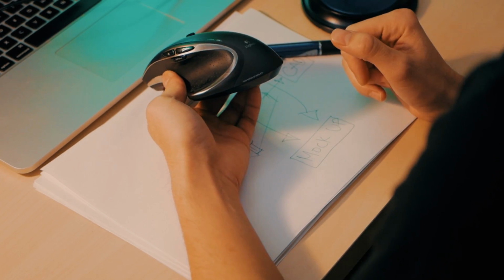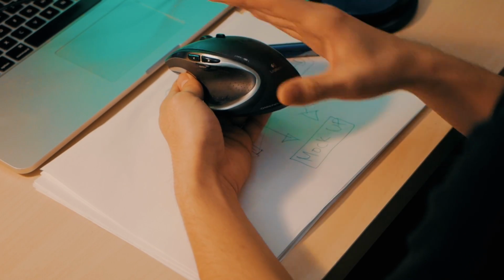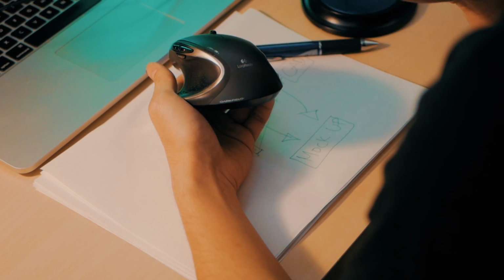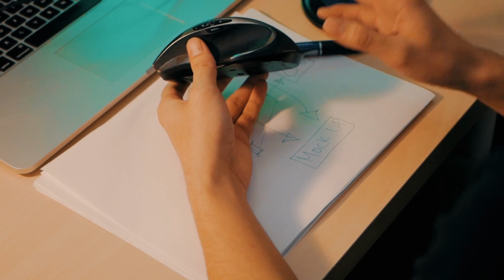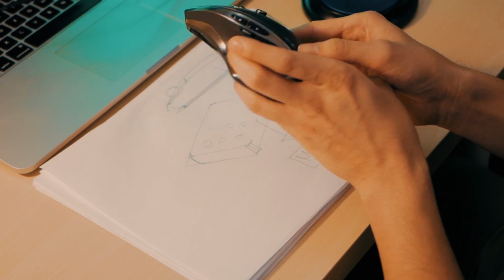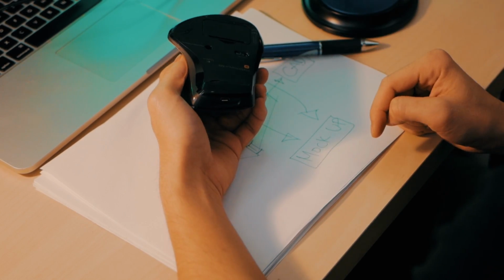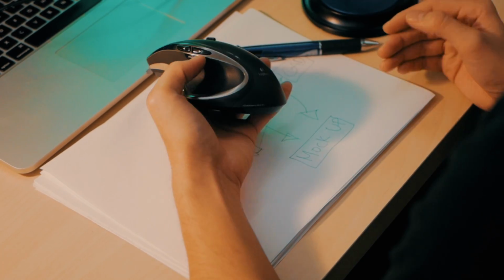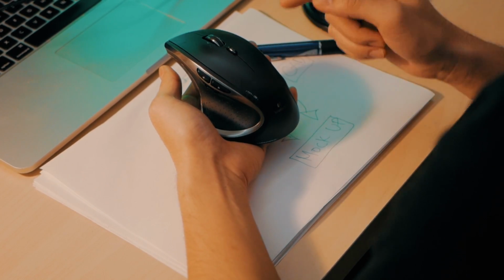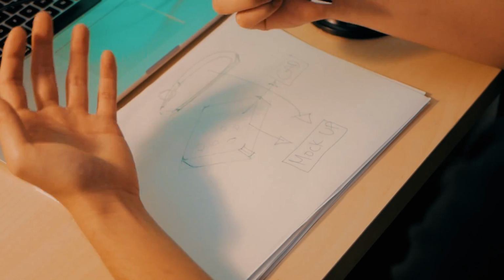This is something that I always wondered too. I knew about 3D scanning, but I was like, so what do you do with that? Do you start cutting away and modifying and changing that file? And does it come with all the features too? It was a missing step that I just didn't have. But what you do is you take that file from the 3D scanner, open it up, turn it around, move it around, and see your mock-up in the CAD program. And so you would use this file in order to create your own CAD file by starting from the beginning. Just like any CAD you would do, you would draw it out, trying to match as closely as you can what that file from the 3D scanner gave you. And so that is essentially the process of creating a computer mouse or something that's extremely organic in CAD.